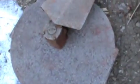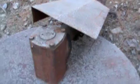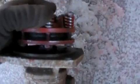Well, yesterday I went to pick up another lot of Graveleys, and in it I got a couple of Model L tractors from the early 50s, and this left-hand brush hog here, which unfortunately is missing the blade off the bottom of it. The clutch on it is actually in pretty good shape, because it was on the tractor when I got it, but you can see the gearbox is stuck. And I think it's the bearing.